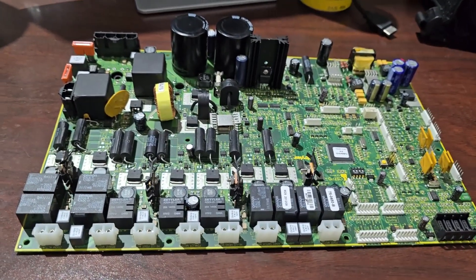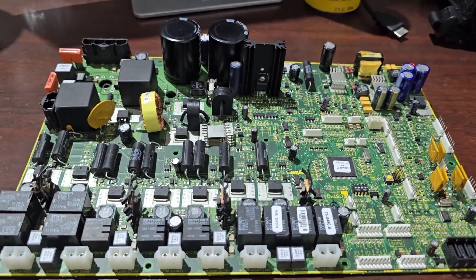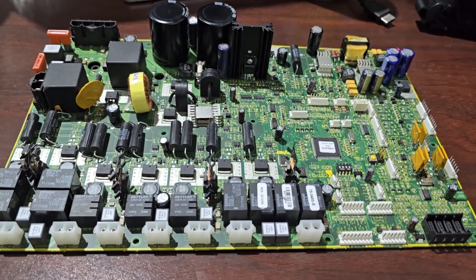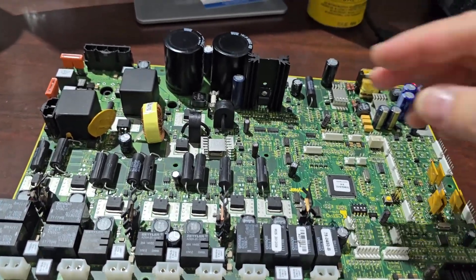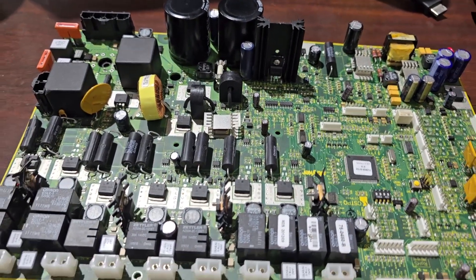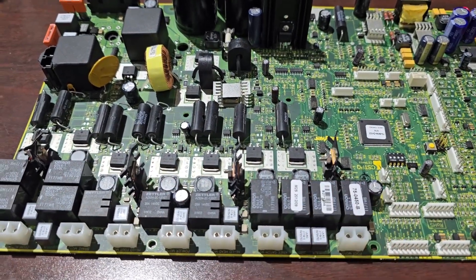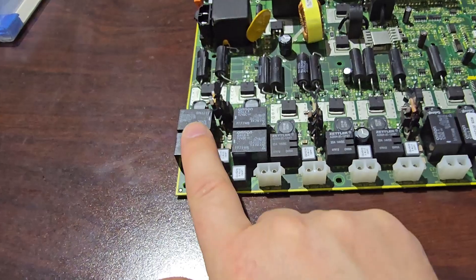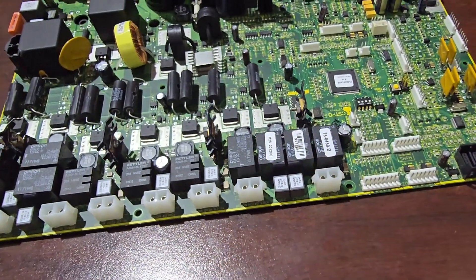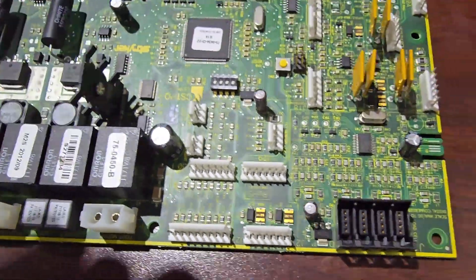Just by taking a look at a board you can walk your way through what it does. I get this question all the time when troubleshooting with somebody: 'How do you know what that board does?' Well, I know because I understand what a DC switch mode power supply is going to look like. I know what motor drivers look like, especially when you see them in a linear configuration like this. I know that motors go forward and reverse, especially when they have these doubled-up relays.